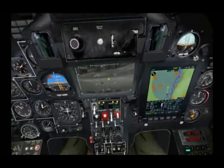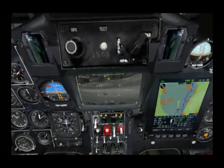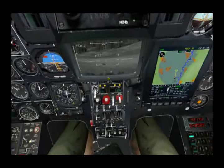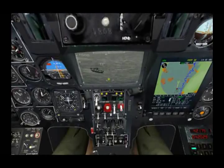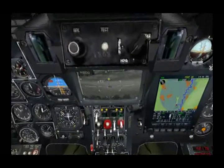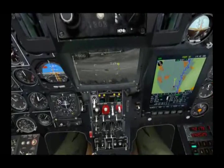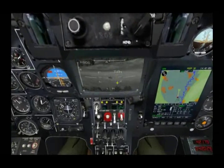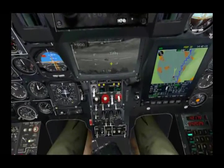I can also go ahead and adjust the size of my tracking gate, either increase or decrease, and I want to keep that about the size of the target I want to lock up — in this case it looks like a Striker out there. I can go ahead and zoom in from 7x up to 23x. I'll put that cursor over the target and hit the lock button again. Now I have what appears to be a TA symbol, which indicates automatic tracking. The advantage of this is that if the target starts to move or is already moving, the sensor will automatically keep tracking that target.